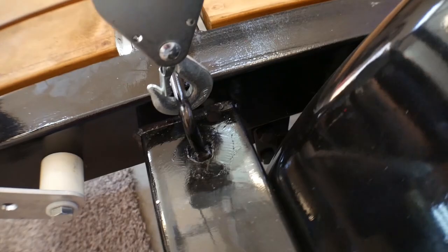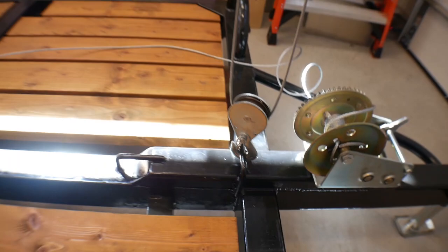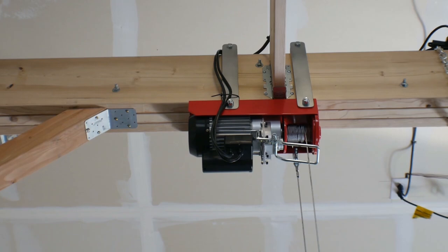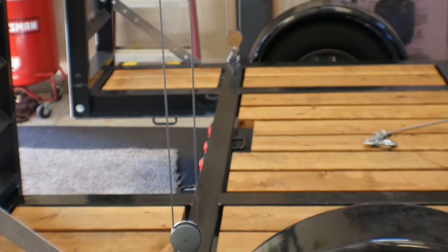So there you have it. I did go around when I was setting this up and I welded a lifting point for each of the three winches, so I didn't want to have any straps or any additional failure points — you just walk up to the trailer and clip it or unclip it. They're not the highest quality winches in the world; I got them from Harbor Freight. But I did take them apart, do a little bit of inspection on them, tighten down the wiring, took a look at things. They're actually not that bad — they're made out of grade 8 hardware and nothing on them was too terrifying. I am running the pulley on all four corners, and as you saw, it only takes about a minute, maybe even a little bit less, to actually raise it or lower it.